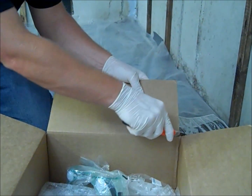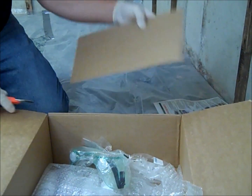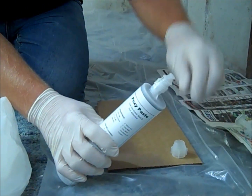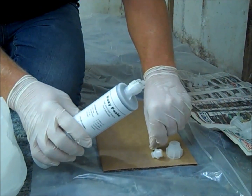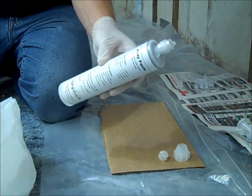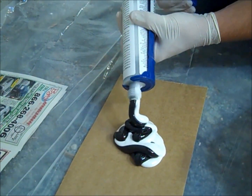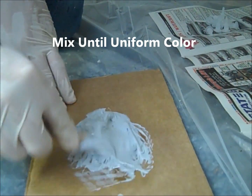Cut a piece of cardboard on which to mix the epoxy paste. Ready the epoxy paste port and crack seal adhesive. Unscrew the cap over the cartridge neck, extract the plugs from the neck, and insert the tube into the caulk gun. Dispense 4 ounces of epoxy paste onto the cardboard and mix using a stir stick until a uniform gray color is achieved.